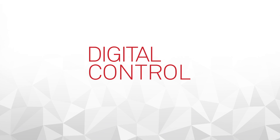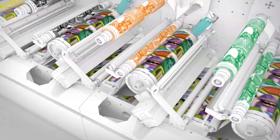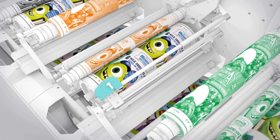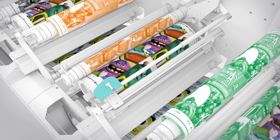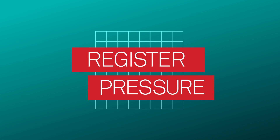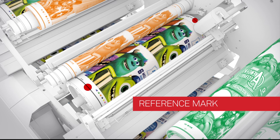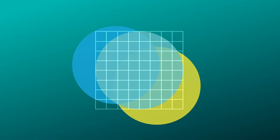Digital Control: The Digital Flexo printing process is monitored constantly. The BOBST Print Tutor Digital Camera was created to adjust the digital setup and the quality of each printed job. It is present on every printing unit, constantly checking what is being printed and, where necessary, automatically adjusting the two basic parameters of the printing process — the register and the pressure. The digital camera shows whether the reference mark printed on the substrate corresponds to the requested quality and, if not, immediately sends out information to adjust the printing register until the reference mark is once again positioned correctly and precisely. This eliminates printing errors, even of the smallest, most complicated characters.